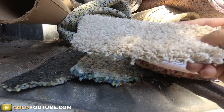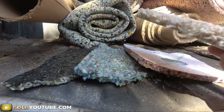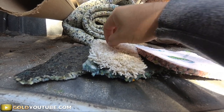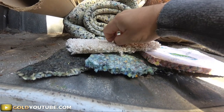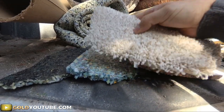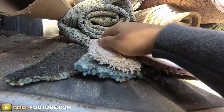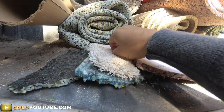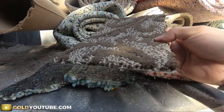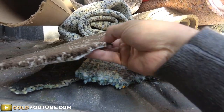Here you have pretty dense carpet, so this one would be good on everything, but I would probably stick with the 7/16 on this one — or even the half inch is fine, it can go on this. But if you really want your carpet to last, I would go with the 8-pound, not a 6-pound.